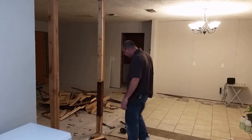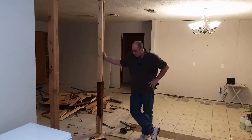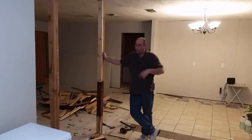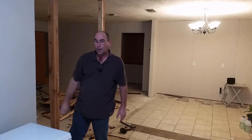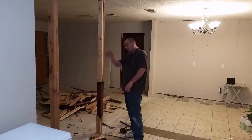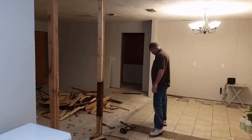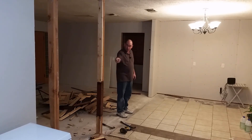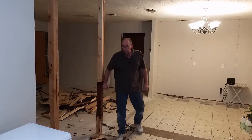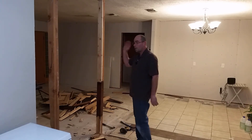That's the pie shelf — it's gone. So next up: remove the sheetrock on the other side of the wall, move the sheetrock back on this wall to that stud and fill in this wall, then re-sheetrock the other wall. We're going to be building this out to right here, continuing the kitchen cabinets all the way to about where the pie shelf was. We'll have ourselves about eight feet of cabinet space — uppers and lowers, counter space.